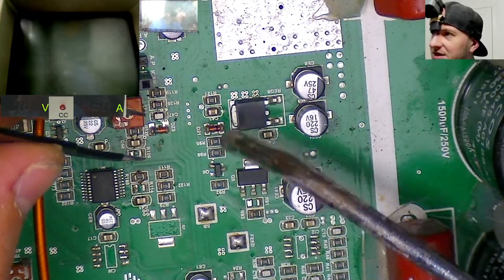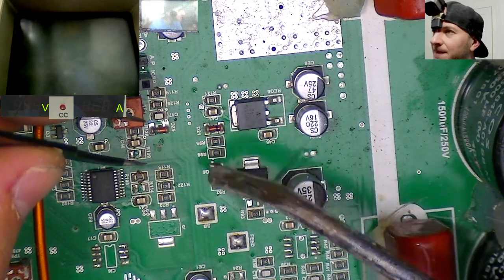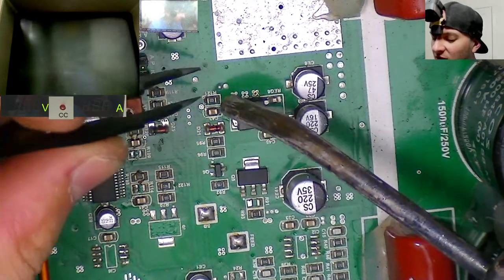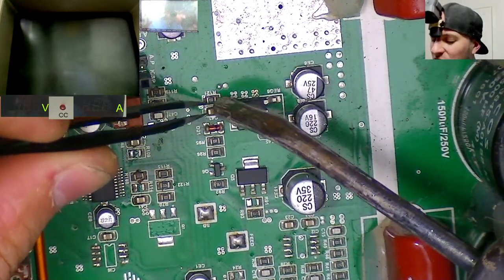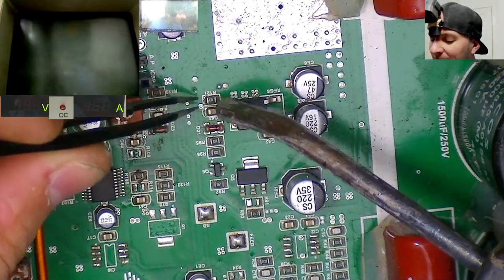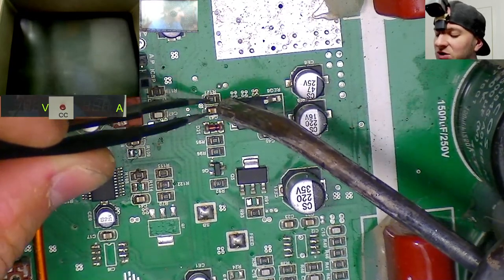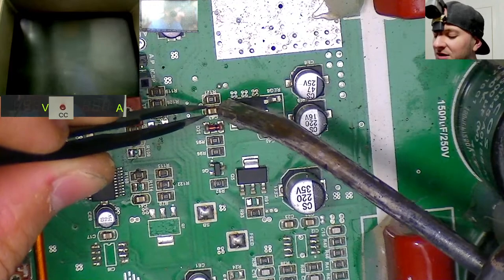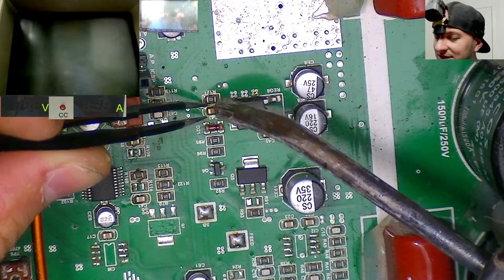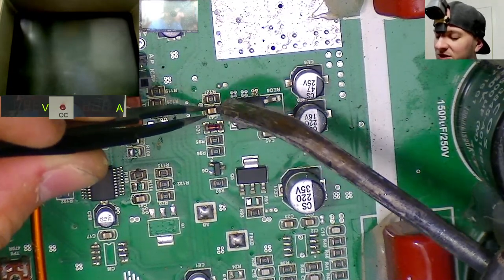Ronnie, the pianist, says this is the 12-volt, 18-volt weird thing. So, Ronnie, can you just confirm? You're seeing 18 volts at which terminals? Output terminals, speaker terminals, or power supply terminals? If you have a 12-volt supply connected, you won't see 18 volts at the power supply terminals, because that doesn't make any sense. That's not physically possible.